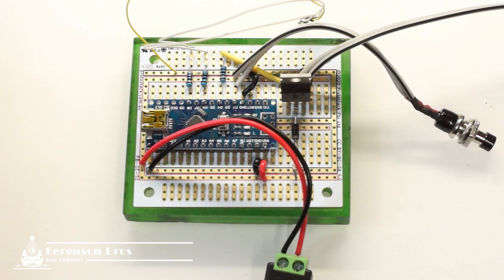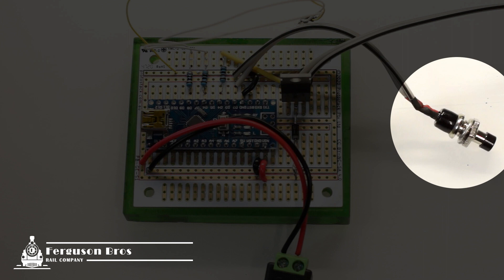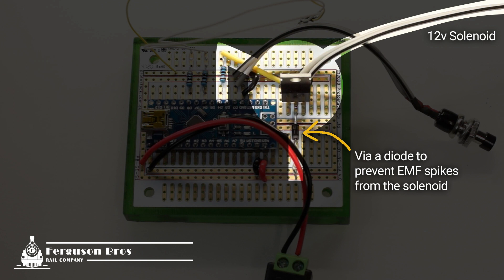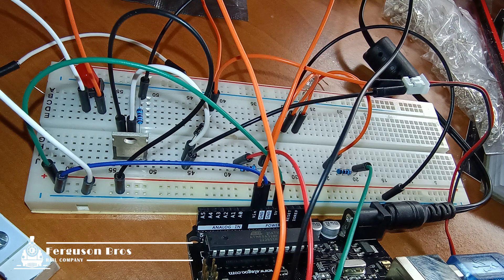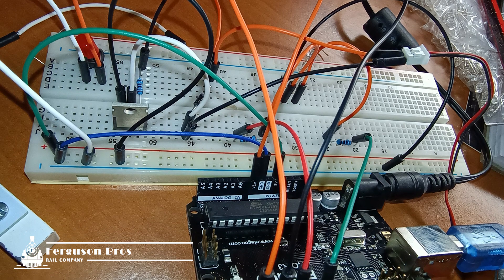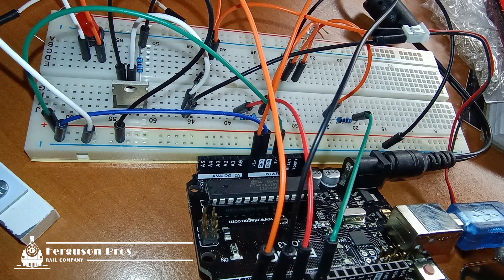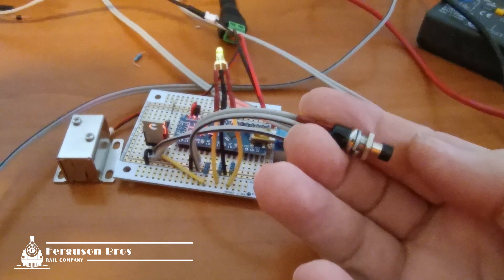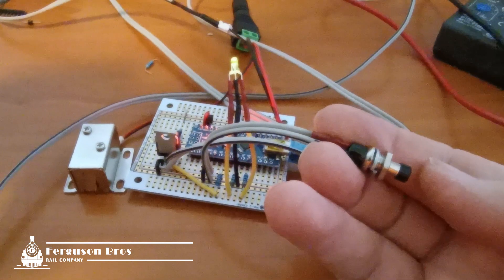I'm using an Arduino Nano and a transistor. Essentially, when the button is pressed, a 5-volt signal is sent to a transistor. The transistor acts as a gatekeeper — when it receives that small electrical signal, it allows the full 12 volts to pass through to a solenoid. The solenoid becomes momentarily magnetised for exactly 2 seconds. Meanwhile, a bi-colour LED changes from red to green to indicate the latch is open. I did a lot of testing with an Arduino Uno first, then soldered the solution into the smaller form factor Nano. One of the things I like about using the transistor instead of a relay is being able to use a single power source to power both the Nano microcontroller and the 12-volt solenoid.